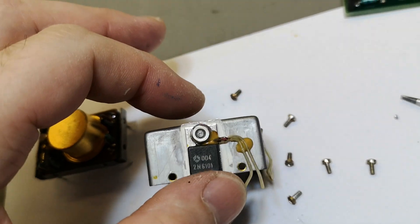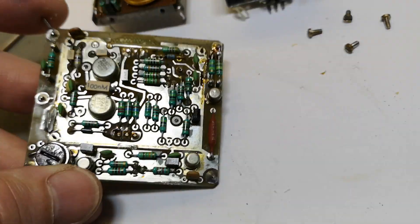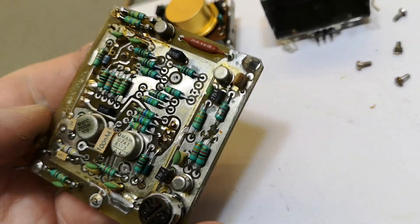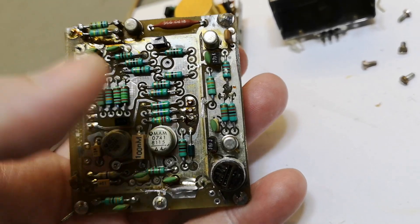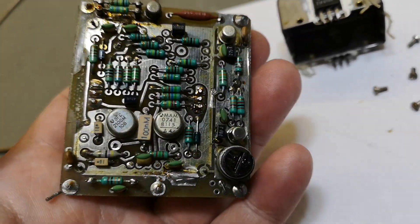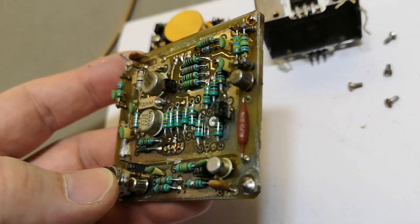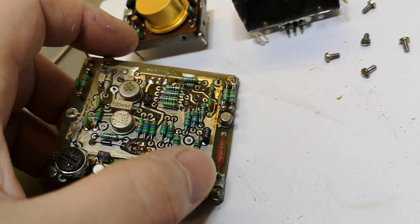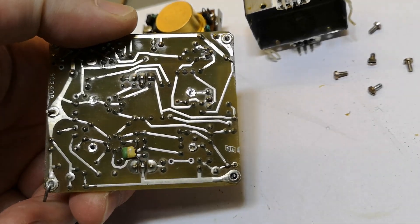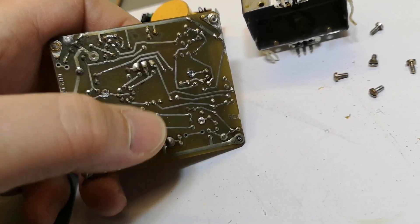I think this metal case could be my new voltage reference case. What I think we can score and reuse: this is a voltage reference, an op amp, and a transistor driver system. Also the four temperature sensors are connected in series all the way around — everything here is really, really good for temperature stabilization. This is the red wire — the ground connection for the two transistors sharing current via emitter resistors. It's a standard op amp voltage regulation integrator.